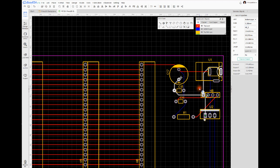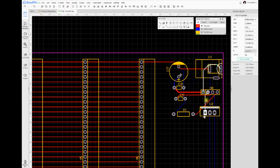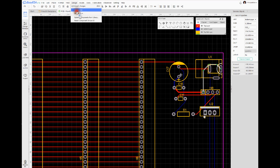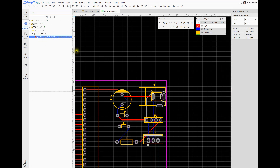That's not based on any science — it's a gut feeling and what I've done in the past. You have to hit Enter in EasyEDA for the change to take place. Then for the ground trace I'm going to make that 0.5 as well. Now I'm going to check the DRC — design rules — because in widening these I may have gotten too close to something else.